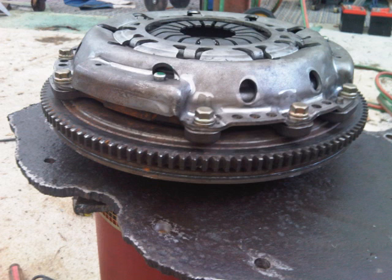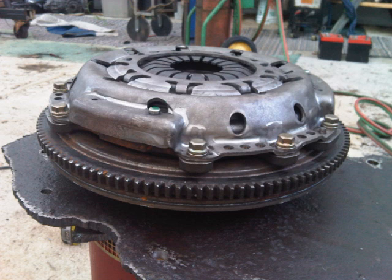Once the whole thing is assembled as it's supposed to be in the engine compartment, we applied 12 volts only — 12 volts is the maximum without load that you put into these motors to test. We started spinning the motor and shifting the plates left and right, pushing a little at a time up and down, until there was no weird vibration or noise. We also had to pull the lever of the clutch because the clutch disc wasn't centered at first — it vibrated badly until we engaged the clutch lever, which centered the disc and let us properly test the plate position.